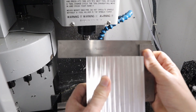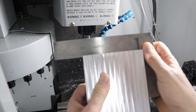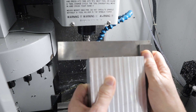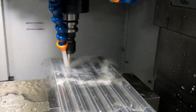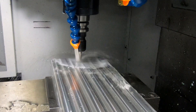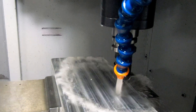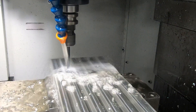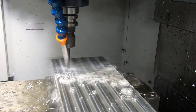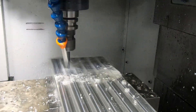If I take the machine square and put it on there, it looks pretty darn good. I started by spotting the location of each of the holes, then drilled to remove material in the center so it would make the next operation — boring — a lot faster. One thing I didn't account for is that because I put it directly down onto the vise, I actually drilled into the vise in that step.